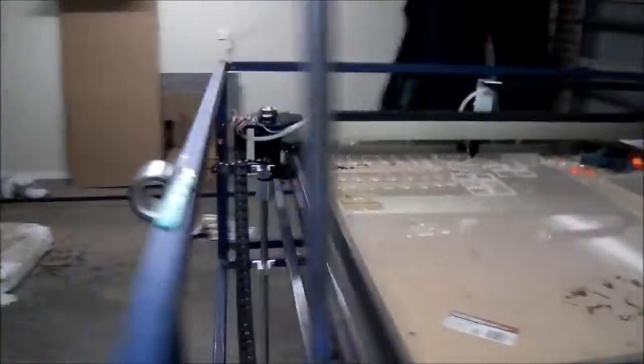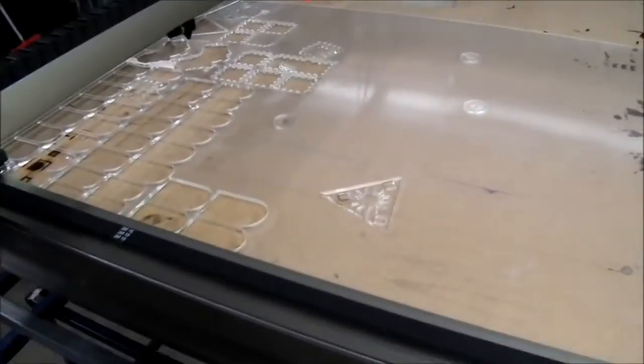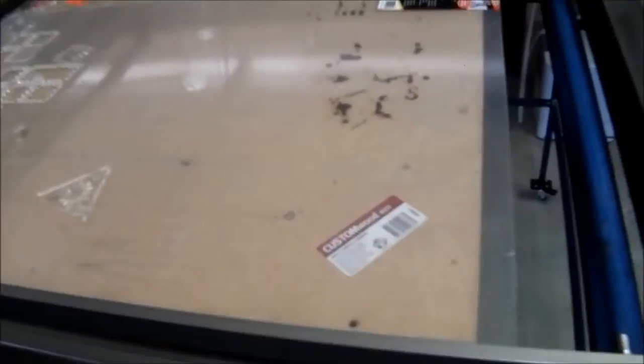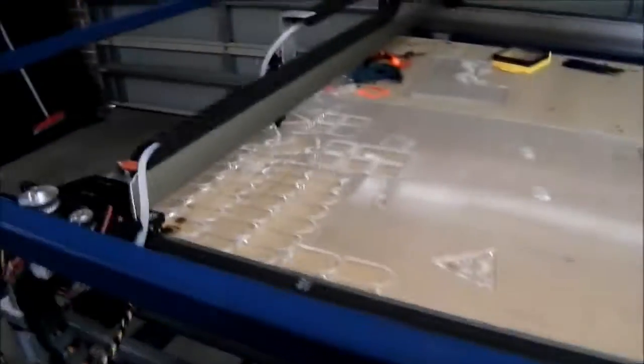Apart from that, it's got a little bodgy water valve on there for the air assist at the moment. I seem to be getting around 6 millimeters per second in 5mm acrylic fairly reliably — sometimes it needs a little push out but it's not too bad. It's not really the optimal setup because it burns the MDF underneath when it goes through, so I've just got it raised up on a few scrap chunks in the corners.